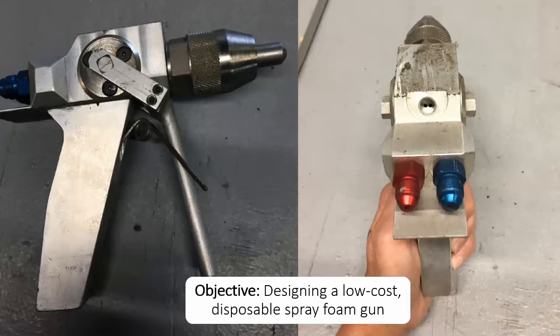The original design of the sponsor's SFG could not mix the two chemicals together to create foam. This led to our main requirement for this project, to mix the two chemicals together for the desired 1:1 ratio. We researched and designed a way to both achieve proper mixing and to enhance the spray atomization of the foam spray gun. The other requirements for the SFG were to be able to handle the operating pressures from 120 psi to 1400 psi. The other goals were for it to be built under $100, utilize an air purge, and produce a spray pattern similar to that of the Graco Fusion spray gun.